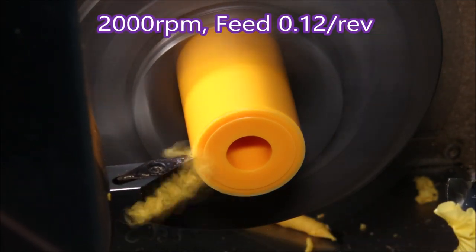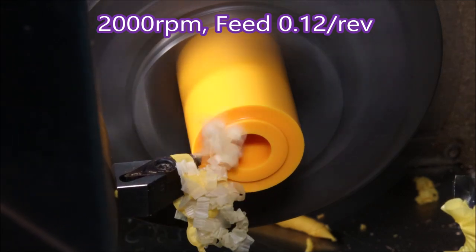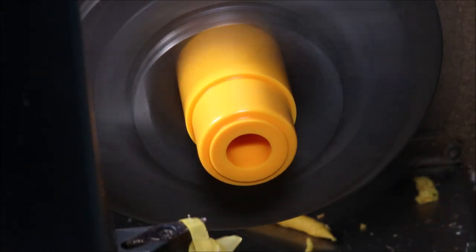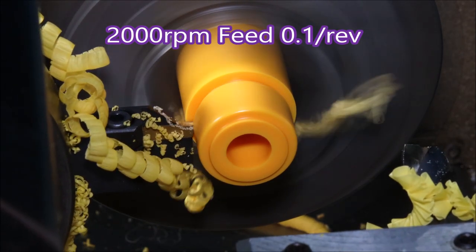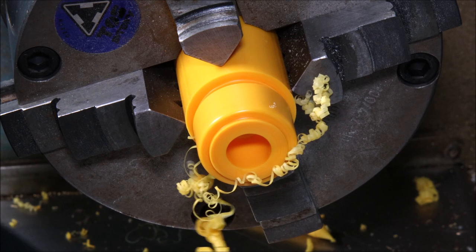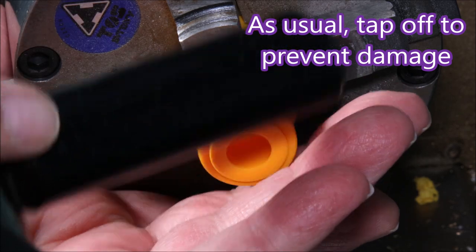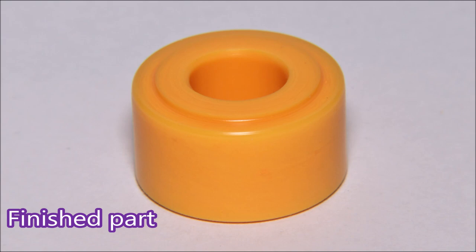Here's the FC Sumitomo insert at work. I find the FC type really good — I use aluminium-style inserts a lot, but the FC is a great general purpose insert for a small CNC lathe because it cuts steel really well too and lasts a lot longer than the aluminium inserts. And here we go tapping off again, just using the nylon handle on my chuck key. Leave a comment if you've used colored acetal before, and thank you for watching.